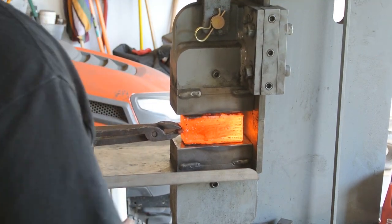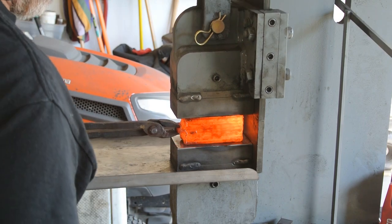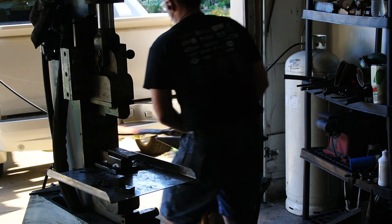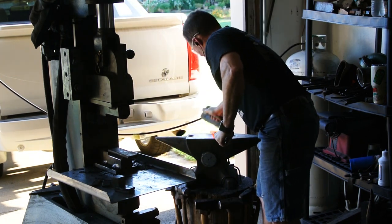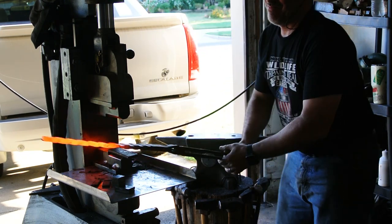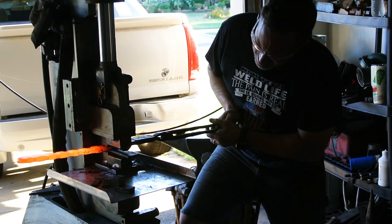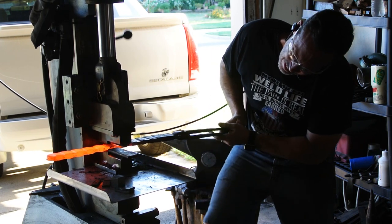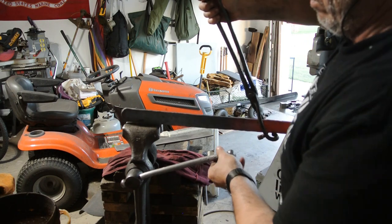Now, because we've actually cut these down a little bit smaller — I think the original pieces were 8 inches and these are 6 — it looks a little smaller, but the layer count does go up significantly. One of the biggest challenges I have while using this press is a lot of the flux and other stuff in the forge — the slag and whatnot — tends to stick to it. So I ended up spending a lot of time cleaning each go-around off all the heavy scale and excess that usually sticks to it. What I didn't show you was cutting those welds off before I did that, but you've seen that.